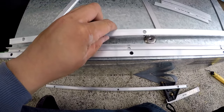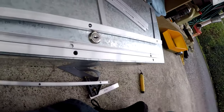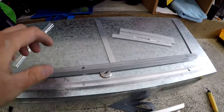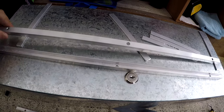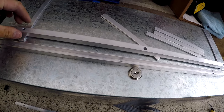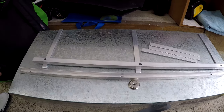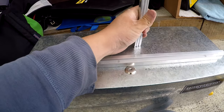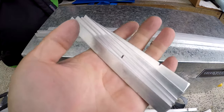All the bars are drilled and ready to go. I went through and deburred them all — the back side is far from deburred but I couldn't care less; no one's putting their fingers up there. Now I need to drill the holes for the support pieces that go underneath. I'm just going to space them out, put a vivid mark through it, draw a circle, then stack the whole thing together, butt them up on one end, and draw through the whole lot. That just makes life easier.